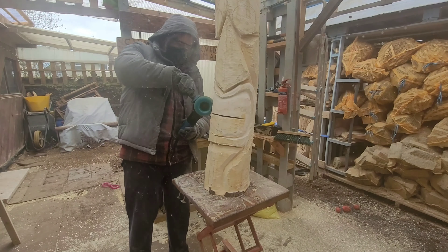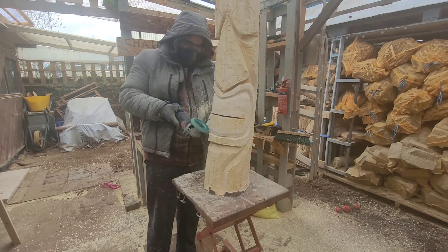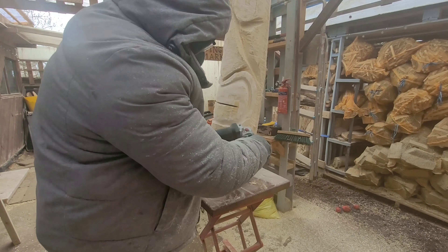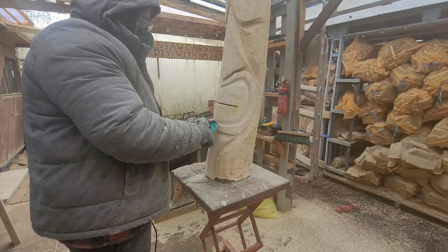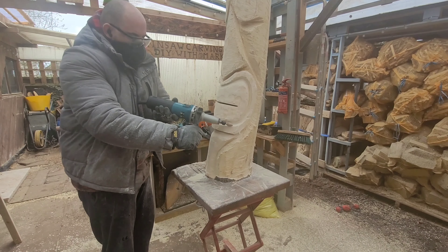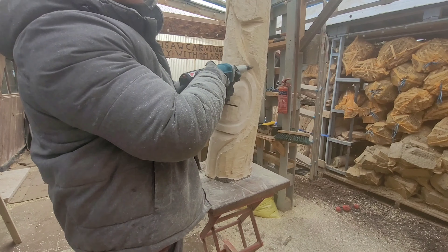I also made another white oak heart and tried to sand that with 36-grit flap sanders but it was just burning up and not going anywhere on the white oak — just making brown burn marks everywhere. The coarse shaping disc did a really good job shaping the outsides, and then I can come back with a finer grit because it's already smoothed out, instead of having burns everywhere. Made that job a lot quicker.